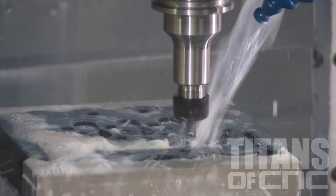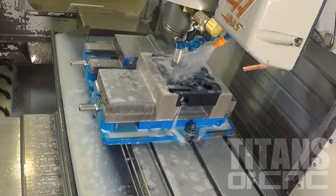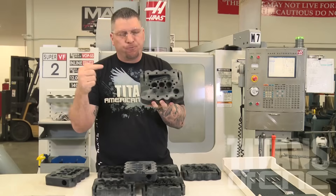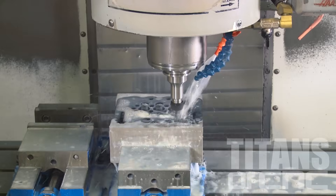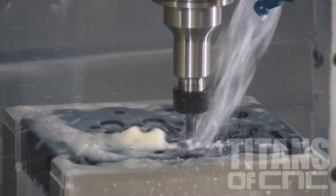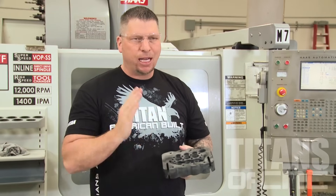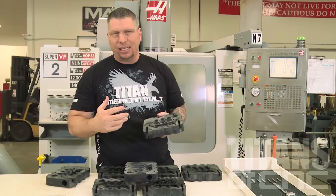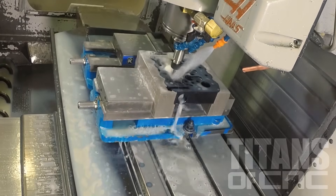Right now on the final operation we're doing all the ball tracking — it's the 3D work right here that gets done for the fluid to flow in and flow through the cavity. A lot of people say that it can't be done in G10, but it's all about the tooling and knowing what you're doing and just taking your time to make a great part. Sometimes we run fast at 800 inches a minute, and sometimes we slow it down to just kiss it and make it absolutely perfect.